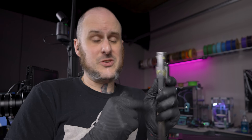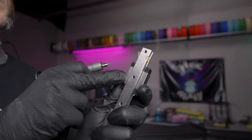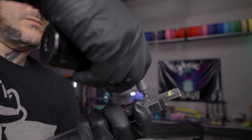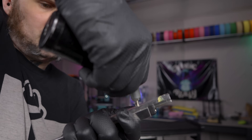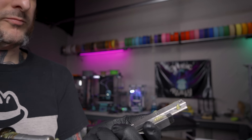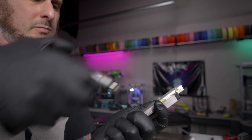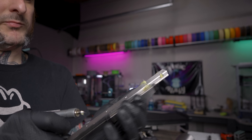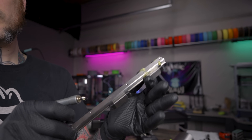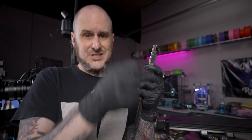My personal preference is to line up the carriage on your linear rail with one of the bolt holes that passes through the rail. Then with this grease gun, I can press it into that hole from the backside of the rail and force grease into the carriage. It will then squeeze out of the sides of the rail, and you can see how well it has penetrated along the length of the carriage. I'll often slide it to one end or the other and repeat that process to make sure I'm getting grease squeezed out all along it, then slide it up and down the rail length, wipe up some excess, and do it again, because there are passages inside the carriage that need grease as well.